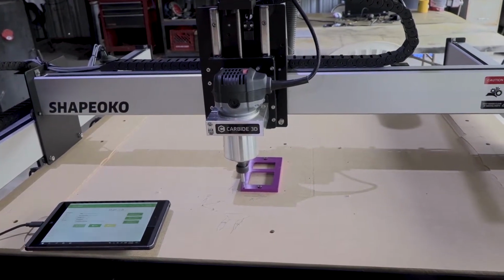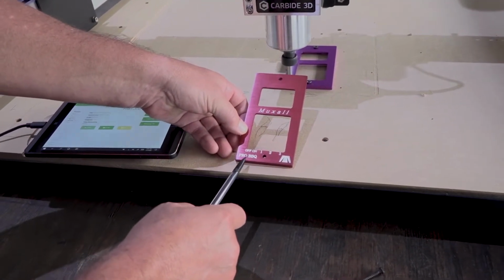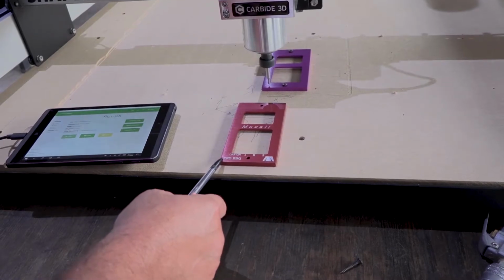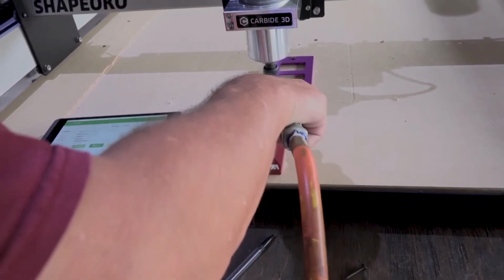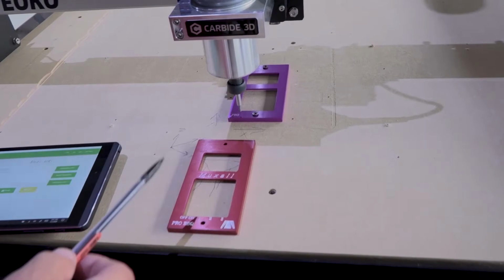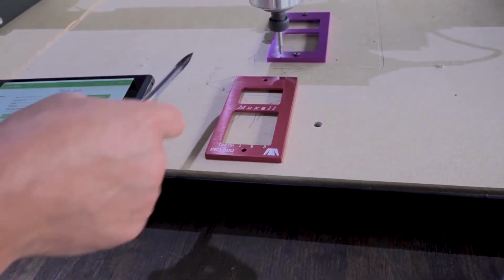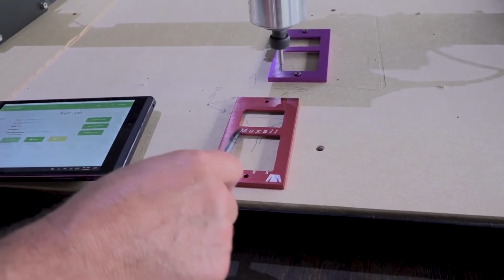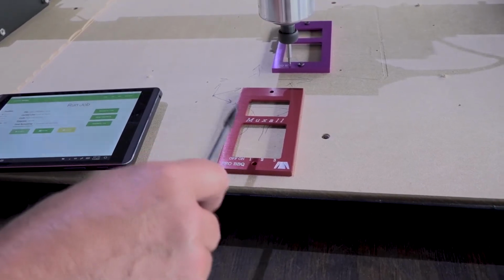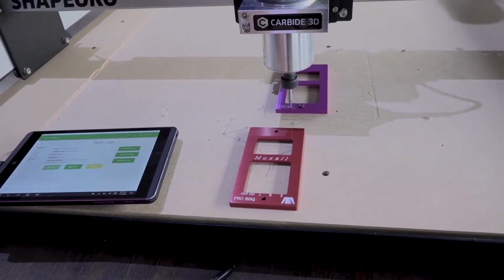And if you're wondering what it's doing, it's going to be doing this part right here, the Pro Barbecue. Okay, now this job is set up to run this twice. Because, as you can see, one time isn't enough. Sometimes 2 times isn't enough. It depends on how hard the anodizing is. But I set all my jobs up to run, except for the logo, everything's run twice. And if I need to rerun it, I just rerun the job twice again. And you'll see what I'm talking about in the Fusion 360. But we'll go ahead and watch this. You'll get an idea.